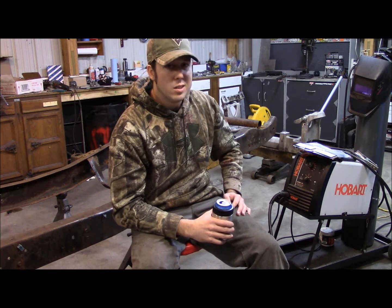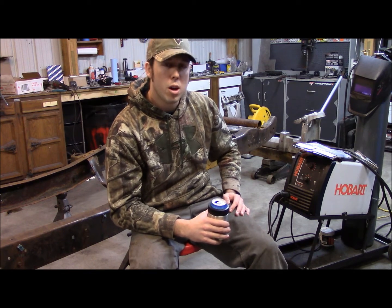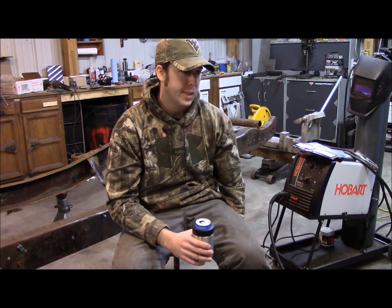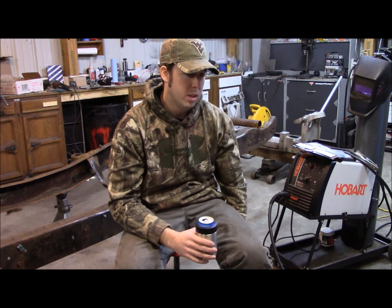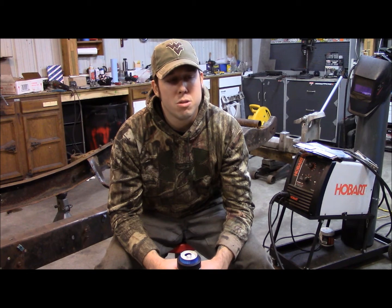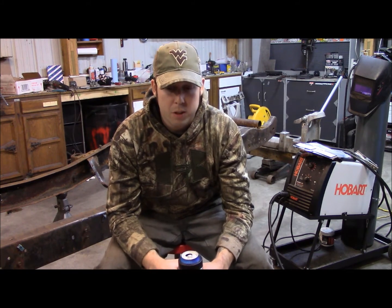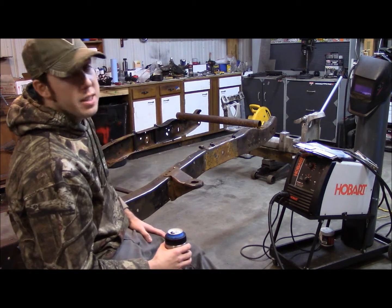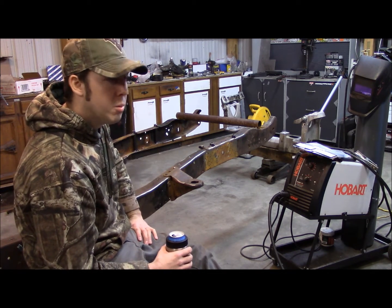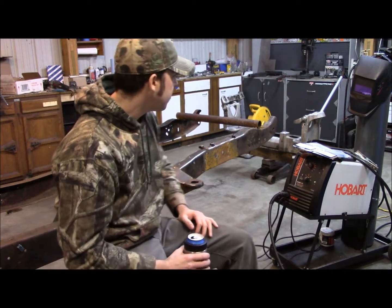Gonna rebuild it, but essentially, if any of you guys are car guys, or hot rod guys for that matter, you know about the Crown Vic front end swap on the F100s. That's essentially for, I think clear back to maybe 51 or 52, up to mostly the 60s era Fords. Not many guys are doing them on the dentsides, the 73 to 79s, but the frames are essentially the same. Widths are the same, everything bolts up front. I'll show you a little bit of detail here later, but you probably can't tell from that angle. But I've already got it cut out, the holes drilled, and crush tubes welded in for this thing, and it's the exact width as the factory Crown Vic 2003 plus front end. So it's a pretty neat swap.